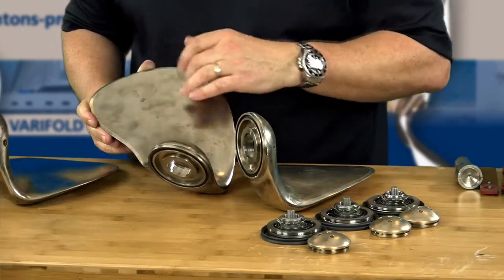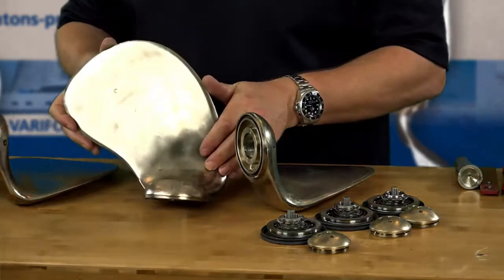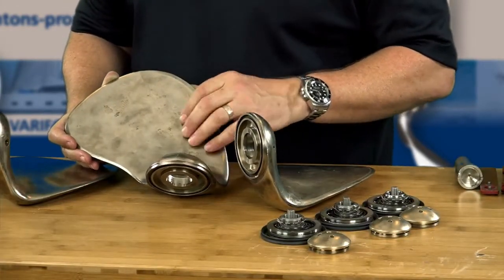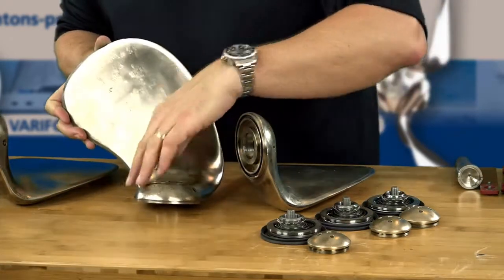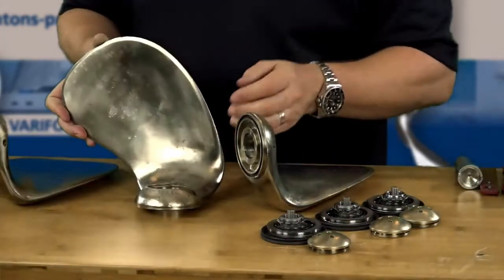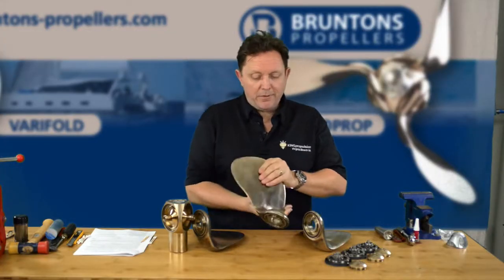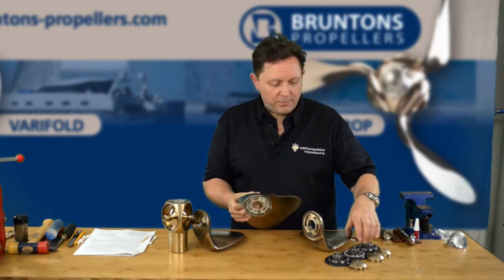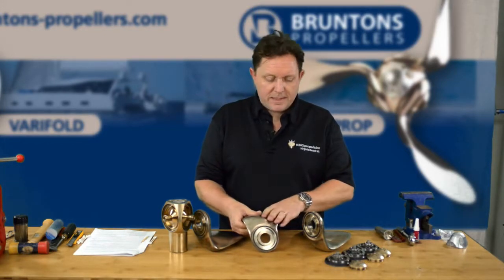They're very, very smooth and have been sanded down. When I took the blue paint off, there was a bottom coat, like a tie coat, and then a top ablative coat — quite a thick layer of paint, obviously done to protect it. And it's done a fantastic job. It's in really great shape. The bronze around here, there's no dings, no cracks or corrosion. So it's a prime candidate for rebuild. You tend to find with the H6 propellers that because you can swap out the bearing races and fit completely new tracks, there's never really a problem. You can always keep them going pretty much forever, provided you keep up the zincs.